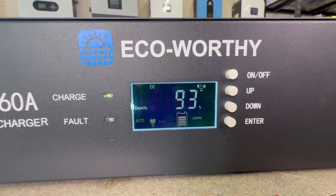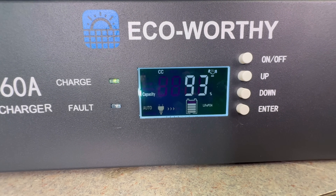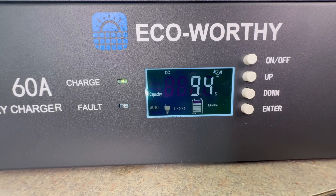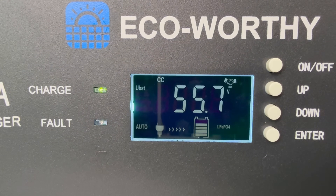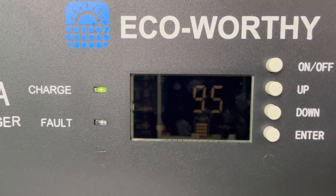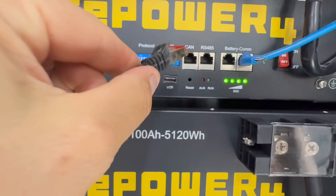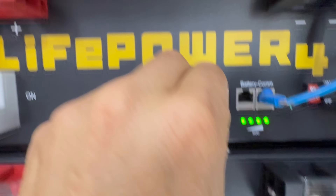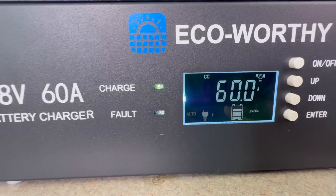I'm going to try it on the RS-485. I would prefer that to be used instead of the CAN because most BMS's can communicate with two things at the same time, so it would be better if it was communicating with the RS-485 and your CAN could communicate with the inverter. There it is unplugged — the handshake should go away. Zero handshakes, so it does have to be CAN communication. I'll try it in this LifePower4 V2 — indeed it can communicate with EG4 batteries as well.